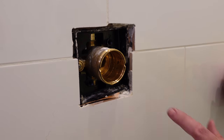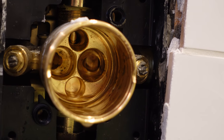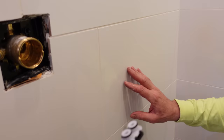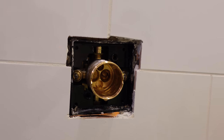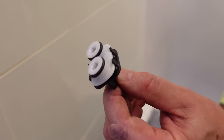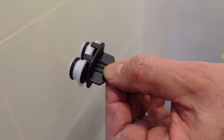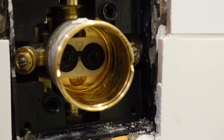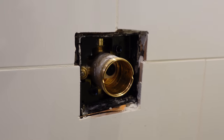Make sure it's all clean inside. Sometimes the top hole will have a screen on it — on this valve you're supposed to remove that screen. The first thing we put in is the adapter assembly. Always refer to the instructions to know whether to remove the screen. The adapter assembly has a couple of O-rings — one for the hot side, one for the cold side — and it doesn't matter which way it goes in. I'm grabbing the little handle, pushing it right into the back into those two holes, then pulling off the handle and using my thumbs to make sure it's seated all the way.